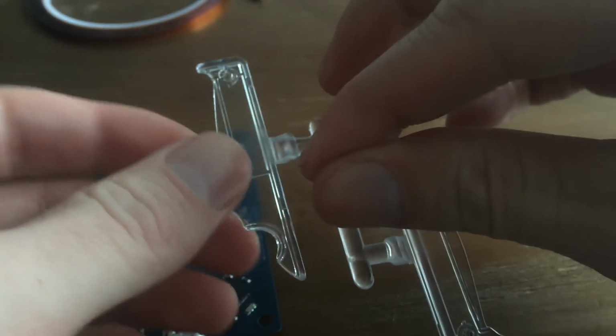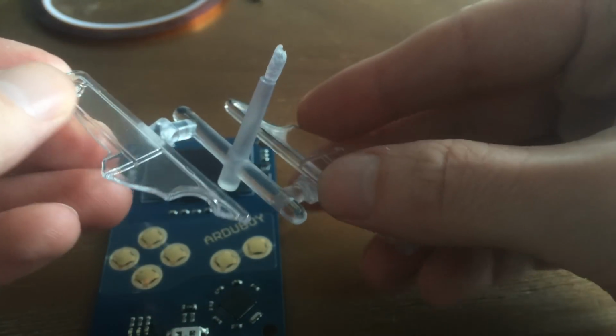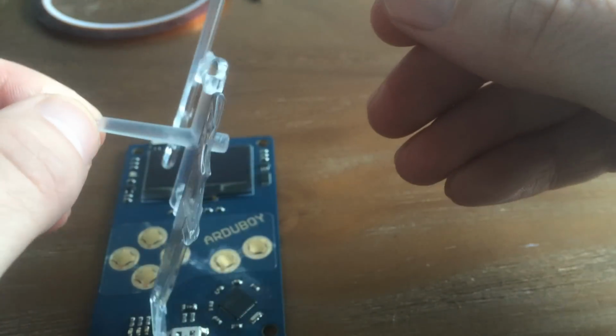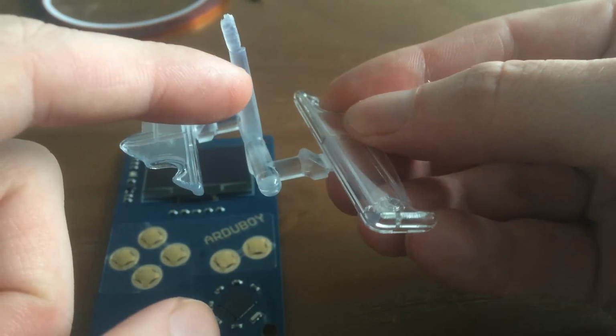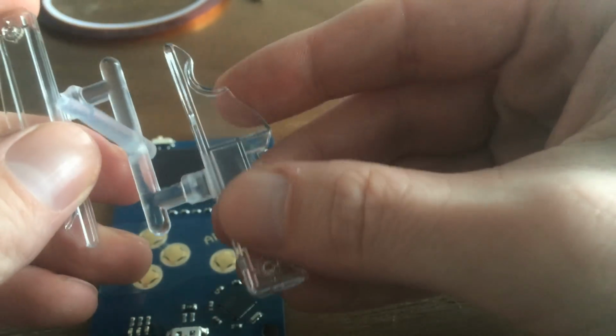We are also able to visit our injection molding factory. This is the very first plastic that was shot out. It didn't make it all the way through the mold. This is known as a T0, like the first time you run through the machine. This is known as the sprue. This is where the plastic first comes in through. Then you have a runner, which goes in through the gate where the product is actually filled.